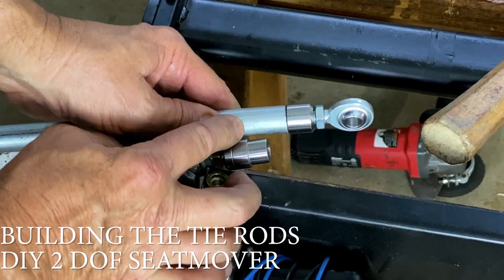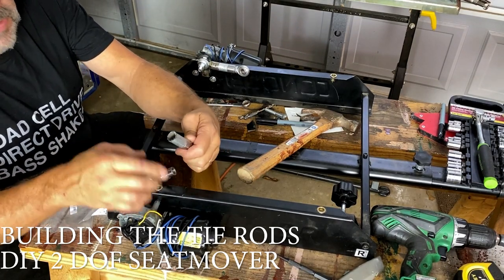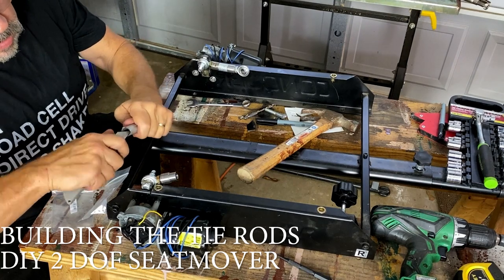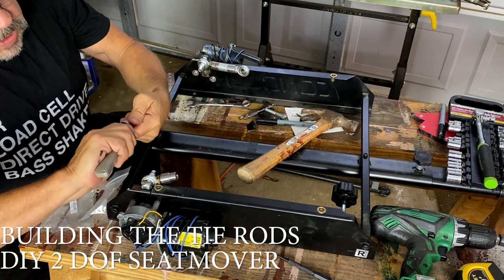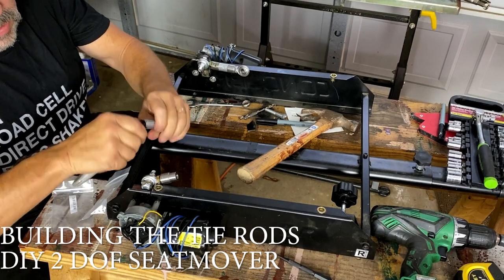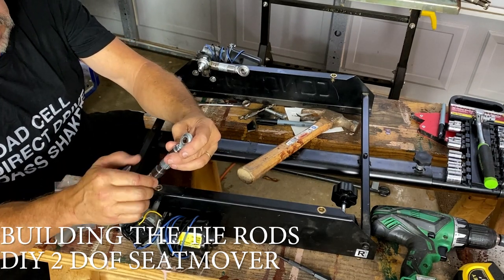Now I'm just gonna have to cut right about here. After I cut that it's not gonna fit on here right away because the inside has a bunch of material in it. Take a razor knife — make sure you're wearing your safety goggles or some kind of glasses — and just scrape it away on the inside. You get a nice chamfer in there, then let it cool down a little bit more. It's still a little bit warm but we're just gonna put it right here.